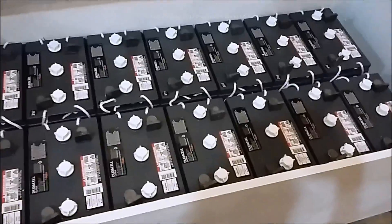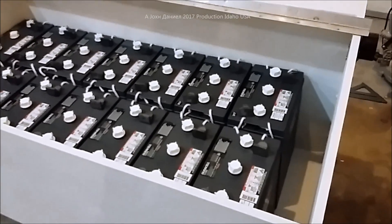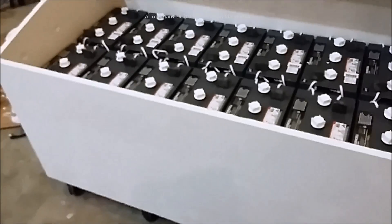Now we have all 14 batteries in the box. Up top we have the vents in, and down at the bottom we have the lower vent for natural drafting — yes, the hydrogen will find its way out. We're going to use a ribbon hinge up here, and there's another piece of three-quarter plywood that'll cross this completely. The ribbon hinge will attach to it, and then there will be a gasket running down the entire lid surface all the way around. That right there is the battery box and it is ready to roll.